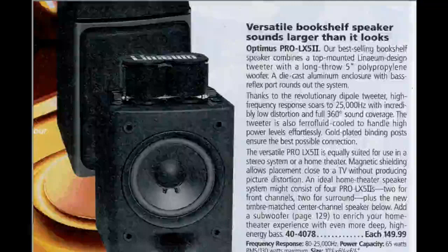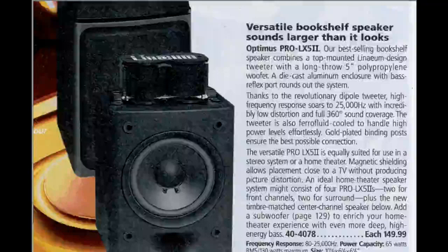You're also able to view Larry's instructions in Word format or plain text — just follow the links on the web page. Larry goes into detail on how he tested and changed the crossovers, and the design seems to work well. The web page is authored by a fellow named Eric, who also has information about replacing the stock woofers with drivers from Parts Express, though I don't know if those are still available. Last week I noticed a slight rumbling from the right speaker, and upon inspection I found it was time to replace the foam surrounds, as they had aged and started to disintegrate.